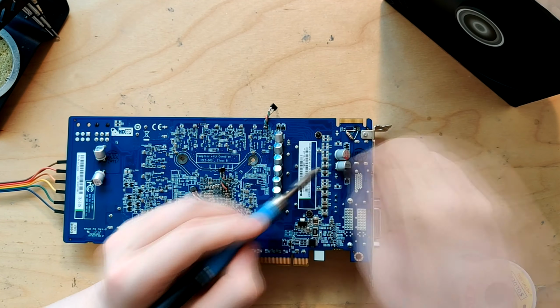And then we have a 2.5 volt 820 microfarad capacitor for every capacitor that was present on the memory and VDDCI output, as well as one for every one on V-core, plus the two unpopulated spots, so that's another 7 extra, so that's more than double on V-core. And I also, this sketches me out slightly, but I'm okay with it for now. These are 1200 microfarad, 2.5 volt capacitors, and I've put them onto V-core multi-layer ceramic capacitors directly behind the core.